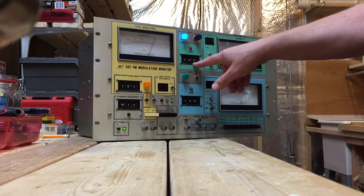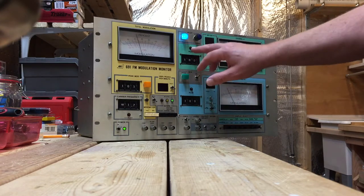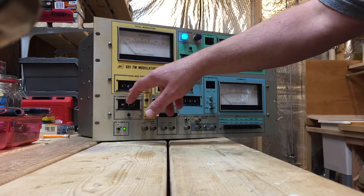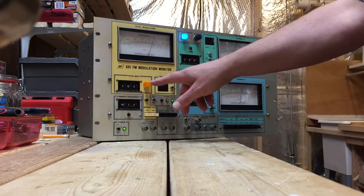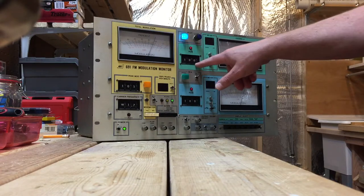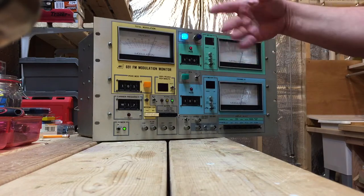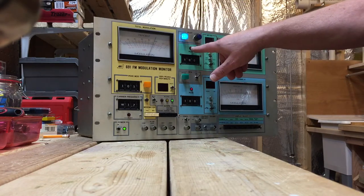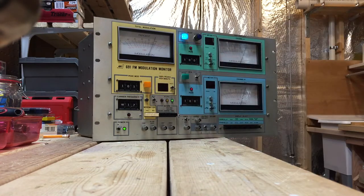One thing I didn't mention: these rotary dials and their indicator lights work on the same basic concept as the peak modulation monitor — setting a warning light threshold. I have these set at 100%, so when the right or left channel hits 100% of its sound modulation, a red light comes on. So it's a red light for the individual right and left channels, and a yellow light for total modulation. That's about it — I said this would be a short video, so let's keep it at that. Thanks for watching.